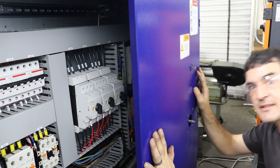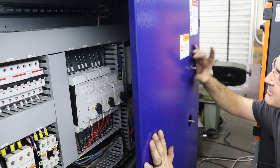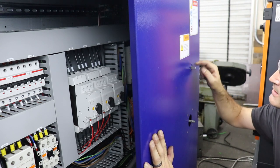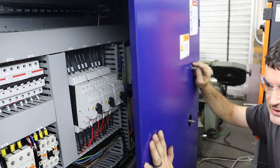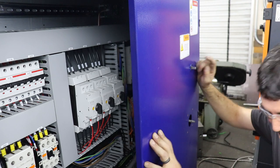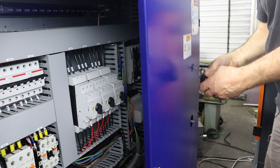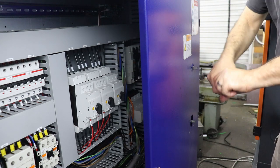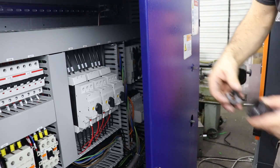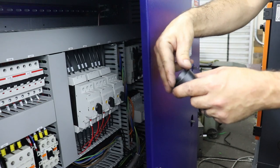Now what we're going to do is punch a 1.5 inch diameter hole in this panel using the Greenlee hole punch, or knockout punch. The 5/8 hole that we drilled, or approximately 16 millimeter hole, is for the threaded clamp of the Greenlee punch to fit through. So this is our punch, and I think I still have a plug in it from last time I cut a panel. As these two come together with sheet metal in between, it slices and cuts out a plug.